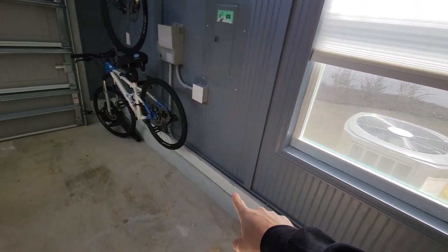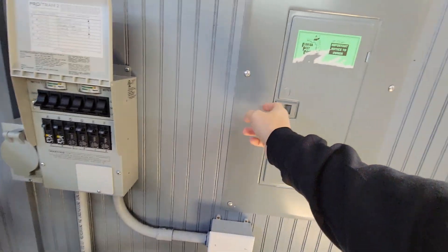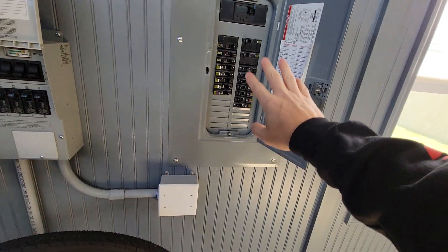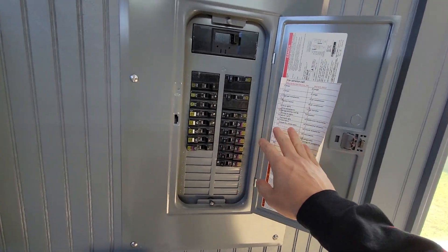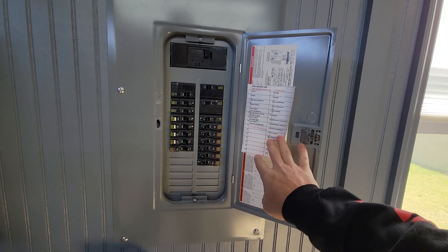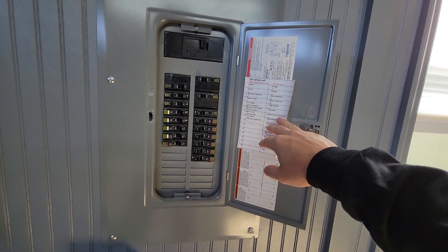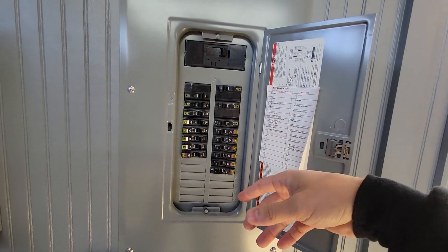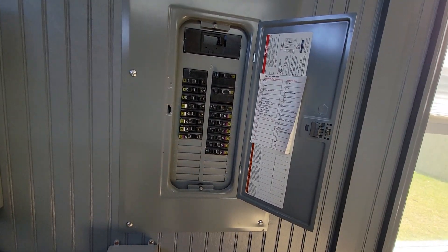When the system is on, it sends power over here to this generator transfer switch, which I also got at Lowe's. This is basically a bypass for your circuit breaker — in the event of a power outage you plug in a generator and wire individual circuits into the circuit breakers in your house. You can choose up to six circuit breakers based on what your generator can output. I chose six circuits that were necessary in a power outage: the refrigerator, the hot water heater — which is gas but has an electric pilot light — kitchen lights, dining room lights, and living room outlets. Nothing too high-load like my AC compressor or washer and dryer.